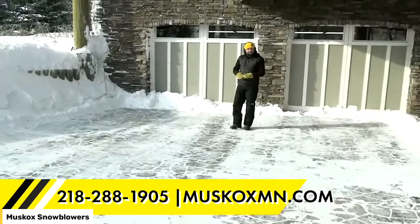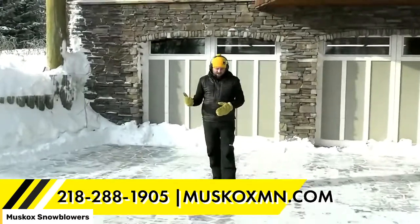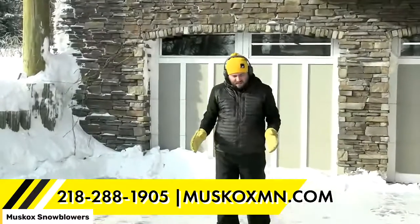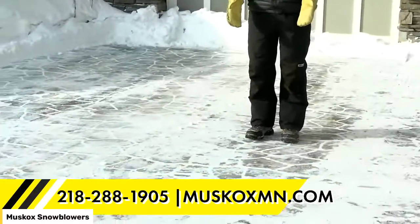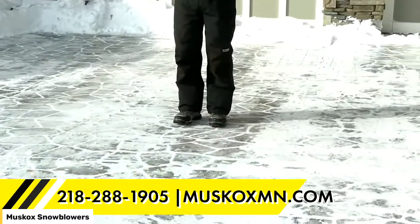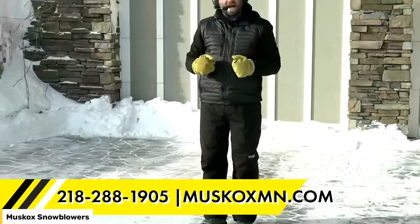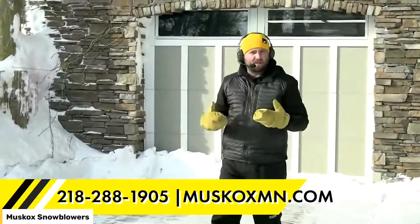As you guys could see, we started off with a minimum of 6 inches up to about 18 or so inches of snow. We got this driveway cleaned, but we're also able to do it over stamped concrete. And we didn't scratch the surface because we ride on plastic components when we're in our forward position. And then when we get in our back drag position, we get aggressive onto this hard surface. We're riding on a rubber cutting edge.